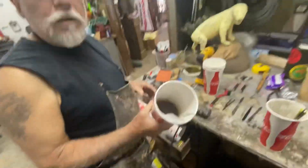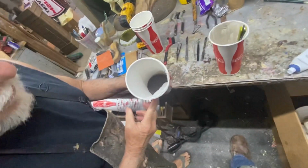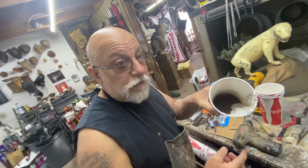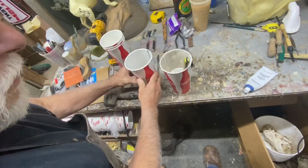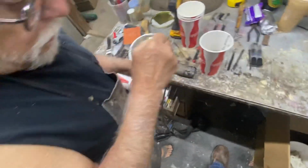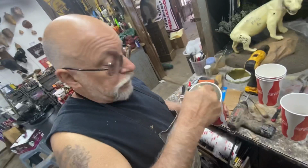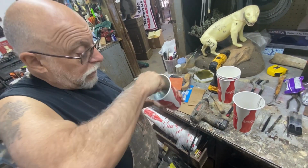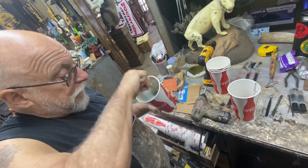We're mixing our gel coat. This process is not quite 50-50 Bondo and fiberglass resin. Now here Matt's getting ready to mix up his with the catalyst. It's an important safety tip too: make sure you catalyze it. Don't forget to put your hardener in there, or you'll be waiting all day. That stuff doesn't have a tendency to set up without the setup agent in there.